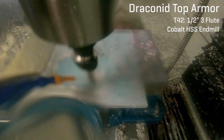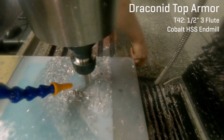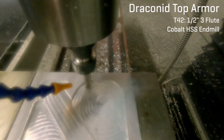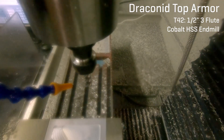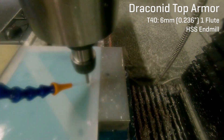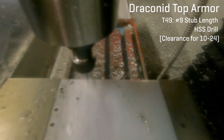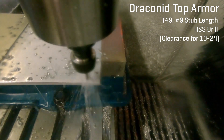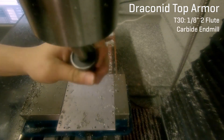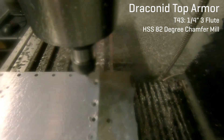I did use the eighth-inch tool to do the holes for where eventually an end-box power switch will be — that's what the four holes with one hole in the middle in the top left corner were. Then swapping in the 6mm tool to clean up all of the corners. I didn't bother with a full contour pass this time because I wanted it to be faster. Then this is drilling with the number nine drill bit, which provides clearance holes for all my 10-24 screws. Drilling is many, many times faster than boring with the eighth-inch tool, which is what I did in a lot of the parts in my first video, because those holes were blind holes — and it's a little bit trickier to get settings right for drilling since chips can clog and rip the drill in half.